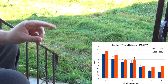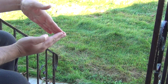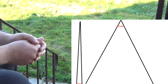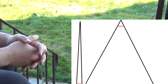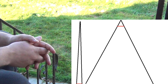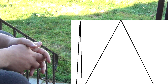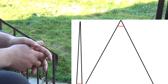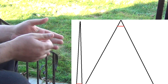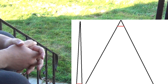Why does that happen? There are two main reasons. The first one is, if you look at a very low apex angle versus a very high apex angle, you have to remove much more material from a low apex angle to get to a certain thickness — and if you look at a graphic, that's immediately obvious. The thickness of the apex is a very strong indicator of sharpness. Apex thickness of around 0.1 to 0.3 microns is considered optimally sharpened — that's scalpel or razor blade level. As the apex wears, blunts, rolls, and develops little microchips, the apex thickens, and it takes much more work to reach that threshold at a lower angle.